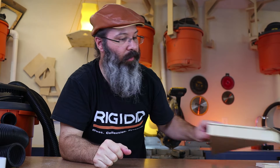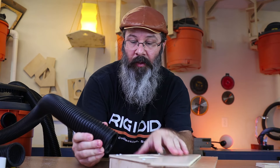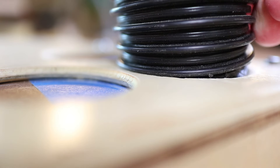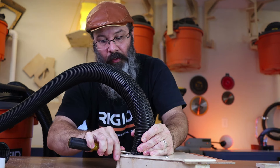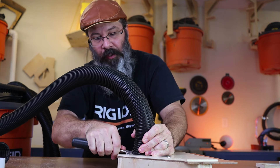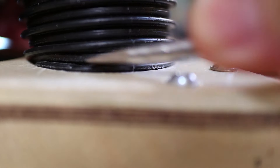So just like the PVC coupling, wherever you've got that hole, you can take the cut end of the hose, put it in the hole, and lock it in between a couple of the ribs. I'm going to start off with the hose two ribs deep and take a flathead screwdriver to work the excess hose into the hole. You have to be careful not to shove too much at once, because if you get a fold in the hose, it won't lock into this hole.